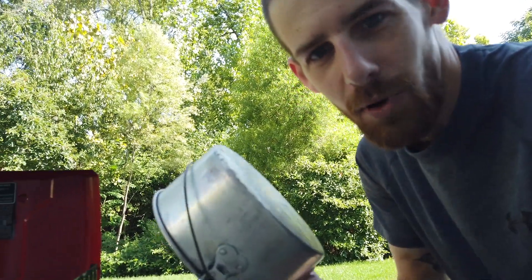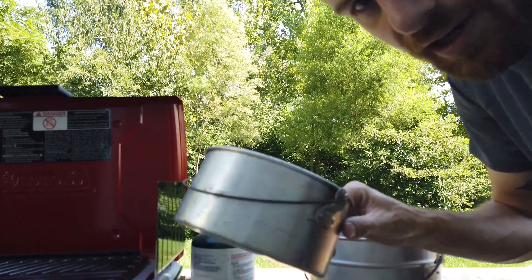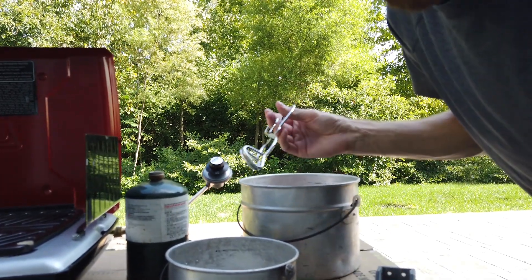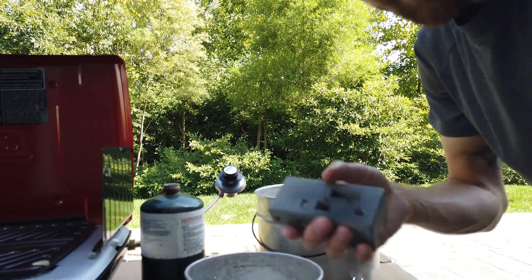Five to eight dollars. We've got a smaller little pan here - this is what we're going to put our regular water in. This will be like our rinse pan once we get done dyeing. And our HP part, MJF gray. I'm going to get the water up and get it going. Get dye thrown in, get water brought up to temperature. We're going to look for like 183, 184, 185 Fahrenheit on the dye. The other pan I'll put on towards the end - it's just going to be base water for a rinse, bringing that up to like 110, 120 degrees Fahrenheit.